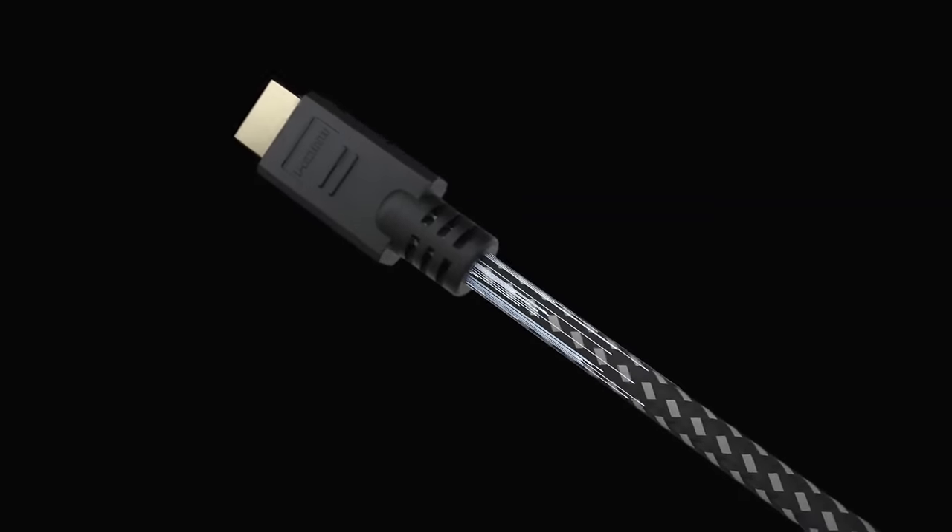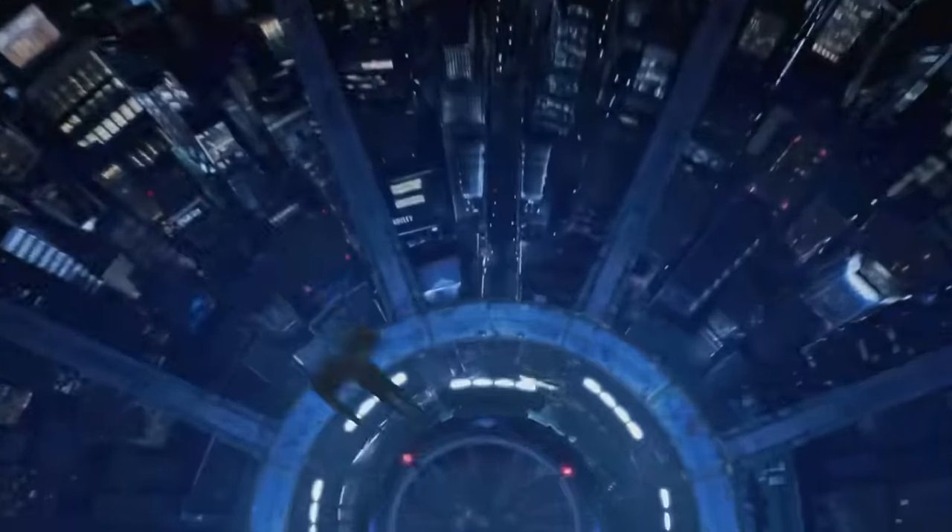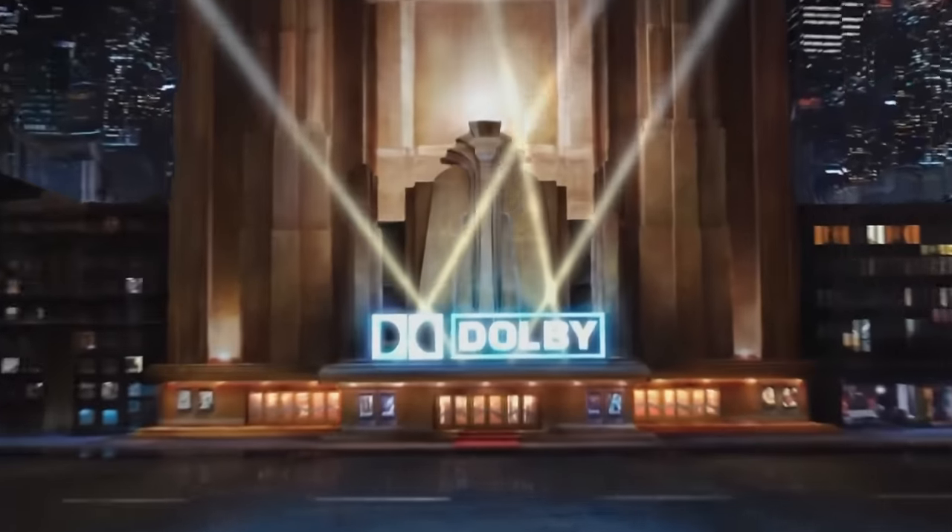SCART also had a pin to send serial data in a manner similar to USB. The format of the data wasn't defined, which led to some very creative implementations. Some satellite set-top boxes used it to send data about the satellite's position in the sky to boxes that controlled the dish. Some devices used it to transfer stored channels or other settings between compatible devices. Philips created a multi-master command protocol in the 1970s, an early form of home automation. Another protocol, AV-Link, allowed for remote control of devices and negotiating video signal types. AV-Link would be carried forward to work through HDMI. The data pins were also used to send Dolby Pro Logic or other surround sound information between devices, but it wasn't widely used. This lack of a standard way of dealing with surround sound meant customers had to send audio separately with RCA cables, which negated many of the advantages of SCART as the audio didn't switch when SCART automatically changed the video source.